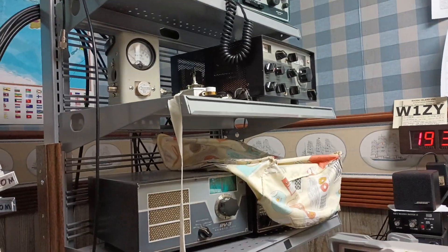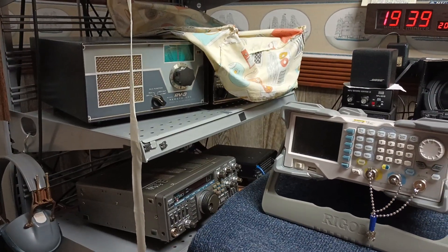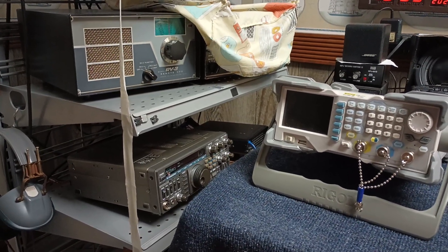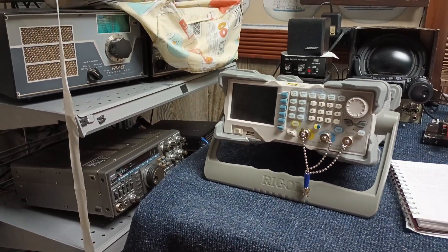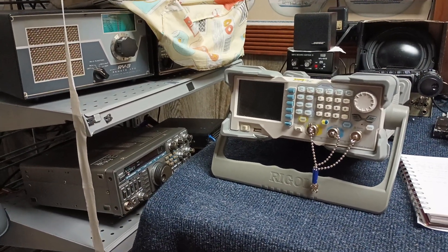So not only does a mismatch bring a numerical loss from the power reflected, but in this case it also led to transmitting a noticeable amount of power off-frequency — and that's a violation of FCC rules. We're not allowed to transmit with dirty, trashy transmitters. So the myth that a little SWR doesn't matter because not much power is reflected? That is false. KB8YP, exploding myths.